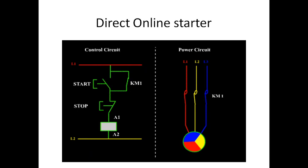Looking at this diagram, initially I am going to give the start signal. Once the motor starts, I am going to cut off — I am going to stop only this particular starter. But the motor will keep running once it has started. I only have a problem with the starting position. Once the motor reaches around 80 percent of its starting speed, I am going to take off the power to the starter.